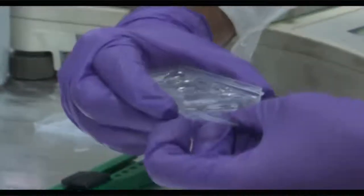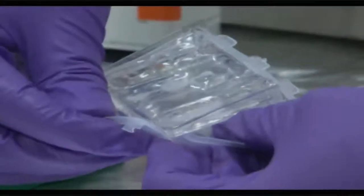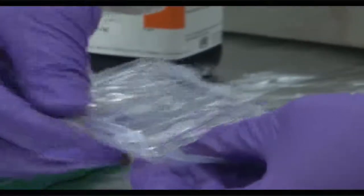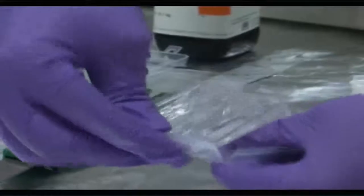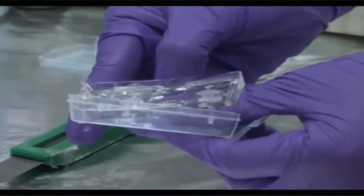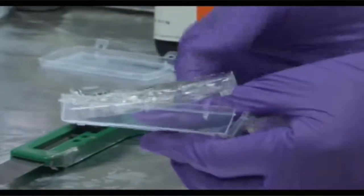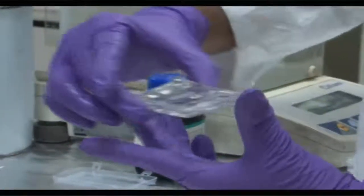There is always a possibility that there is some kind of infiltration of PDMS on the lower side of the PMMA mold. You remember when we did this fitment of the PMMA mold, although we put double-sided adhesive tape on the bottom, still there are some gaps, and there is a possibility of the PDMS going on the back side of that mold, and when it gets cured there is a rubbery membrane developed there also. So one has to be careful about cleaving that.